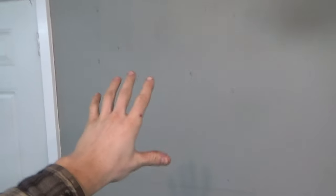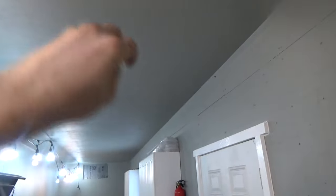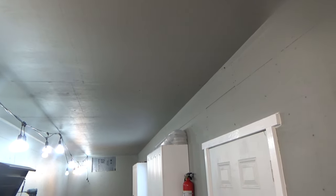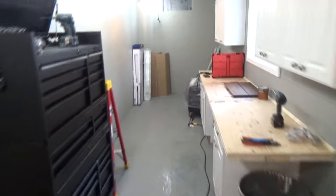But anyways, we're gonna have a panel and probably some sort of data distribution just above it here. Main panel, 2-inch EMT 90s into a splitter on the ceiling, which is then gonna surface down a pipe rack down the ceiling, both ways from that. So everything's nice and neat and organized. And down the center ceiling of the CCAN, we're gonna have 5 vapor tight LED fixtures from RAB that I've started to break down so we can lay out and start mounting lights.